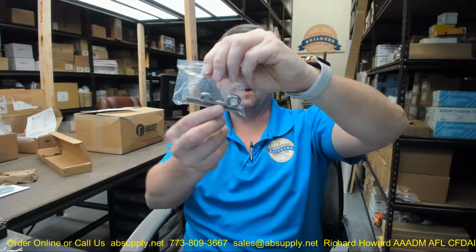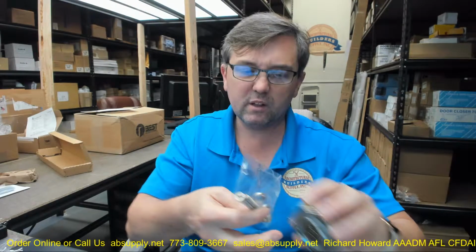There's also a document called Mounting Detail that will show you the mounting options available for this model of handle, and that is indeed what you need to select when you order it. This client happened to order a Type 1. They also specified a door thickness of 2 1/4. That's why these bolts are so long. They may not look long to you on the camera, but they are indeed longer than average.